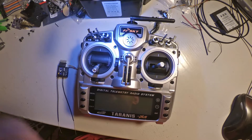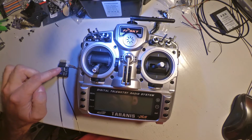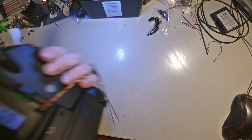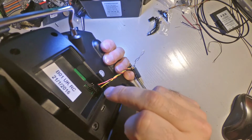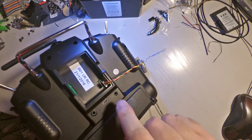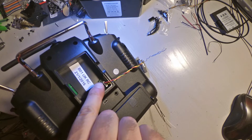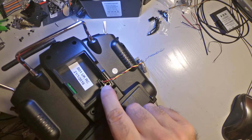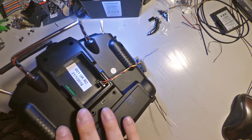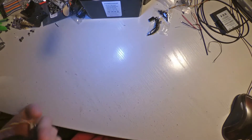The way we can solve this is by updating the firmware on the X4R. It's pretty easy. You only need the provided smart port cable connected to the X4R smart port, and also connected to the bottom 3-pin on the internal module. The very important thing is: for flashing, you need to swap the black and the red cable — red on top, black in the middle, and the yellow signal on the bottom. That's only for flashing. After that you can swap it back. This is important — failing to do so could burn your X4R.